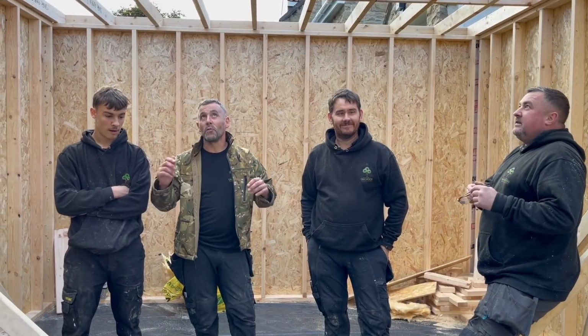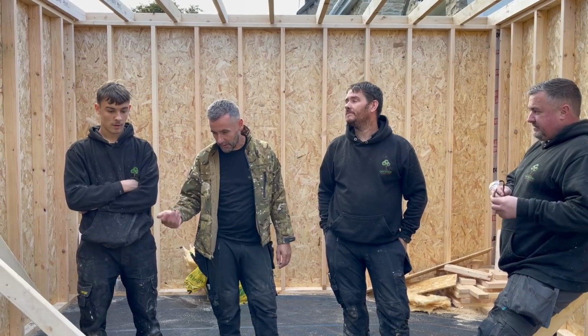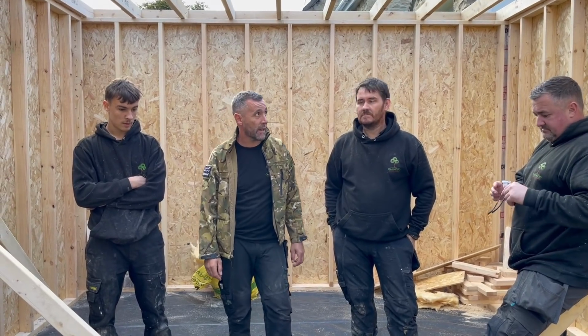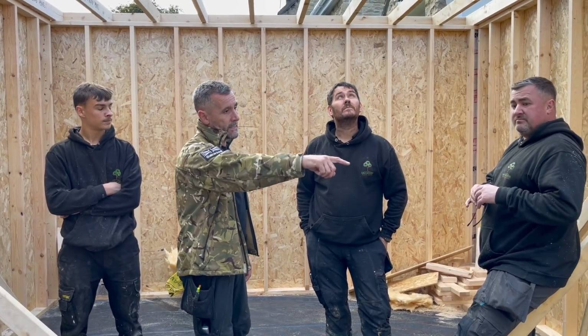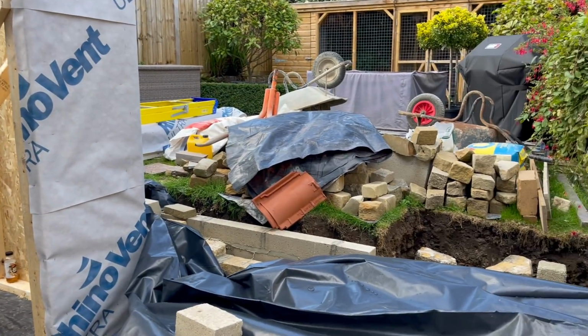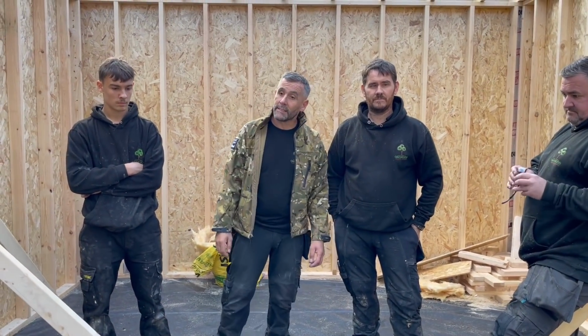That's your walls, that's your roof. It's in excess of 2.5 inside, but by the time we've plasterboarded it and got his floor, he'll have his 2.5 internal height, which will give him his gym. Of course, it's bigger than normal, but if you look at his land over there, he's dug down, so at the highest point of land adjacent to the building, it still falls under permitted development. So that's it, that's Friday.